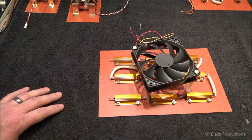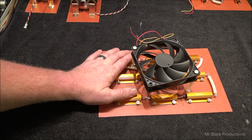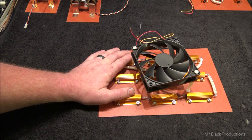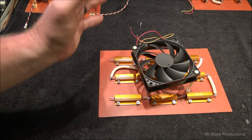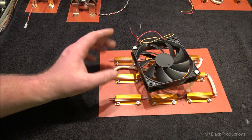You have a power dissipation chart that you can apply to the circuit. And this is a calculated amount of resistance. Okay? You don't want to be so aggressive that you're actually going to pull away from your working load, but remember our power supply is like 5 amps, 6 amps worth of current that we're going to be pulling, and we're only going to be pulling maybe a 16th of an amp out of the circuit. I'm making numbers up off the top of my head. I can give you a calculated amount of resistance and a calculated amount of amperage consumption.